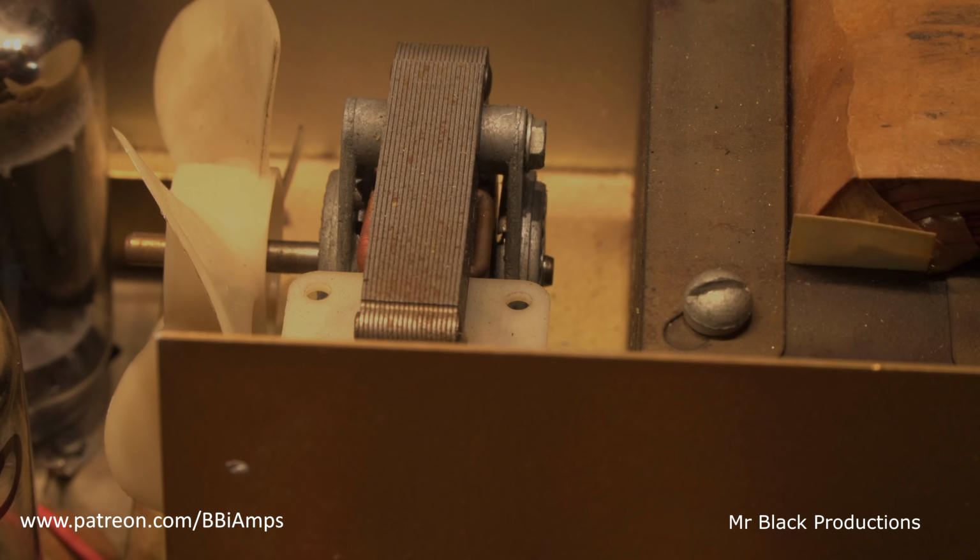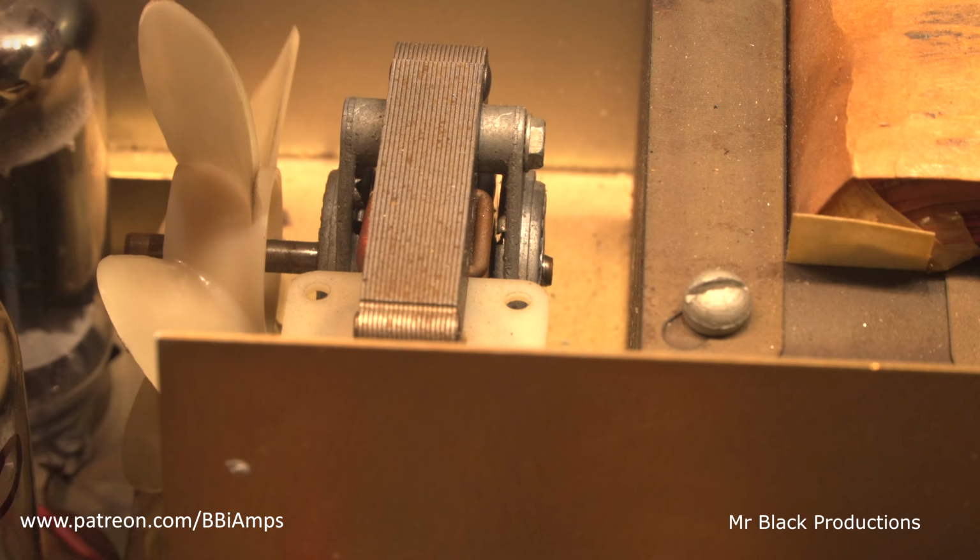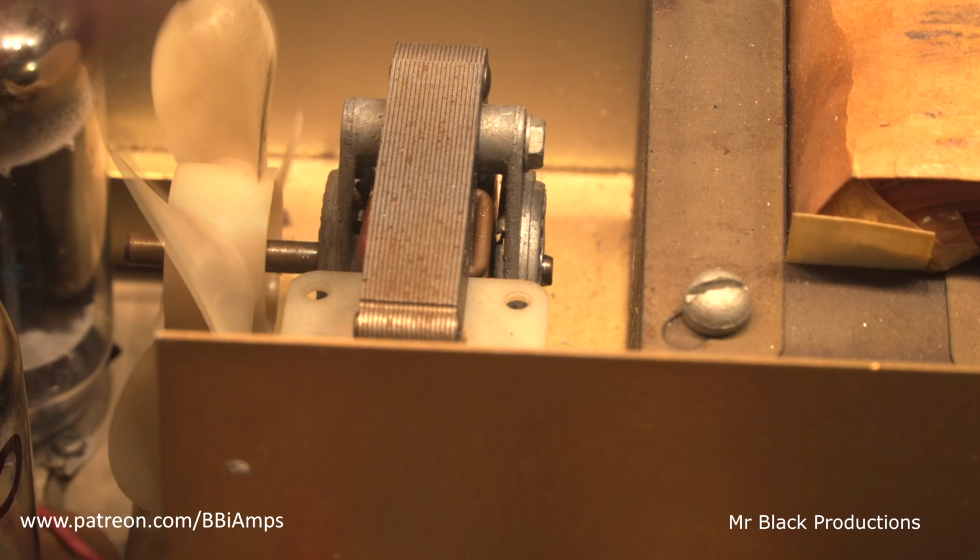That's still a little too tight. There's little tiny felt pads that maintain the lubricant to the bushings, and sometimes those felt pads will dry out a little bit. So we go right down through this oiling hole. There it is. There we go. It does not take much.